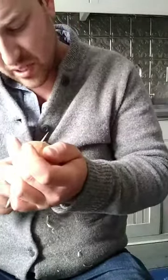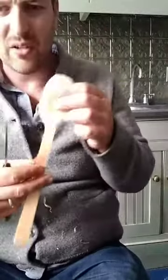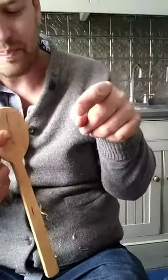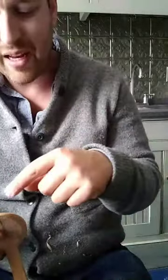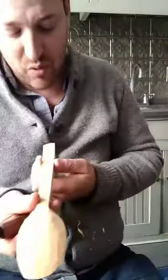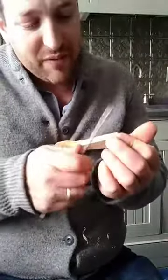so that's a great example, actually, both of why I carve the bowl last so that you can adapt, but then also if there's a problem like there was in that spoon, I always try and run right at the problem and see if I can eliminate it and make it go away, because I want to know before I invest any other material, any other time in a spoon, if I can make it right. So that spoon would never have gotten that far if that crack hadn't showed up after I'd done the axing and all that stuff. It was only while I was rough carving it that it appeared that there was that minute crack in the spoon. So typically, if I see something that might go wrong in a spoon, I dive right on it and try to see if I can make it go away, because I want to know before I sink any other time into the spoon if I can resolve it or not.